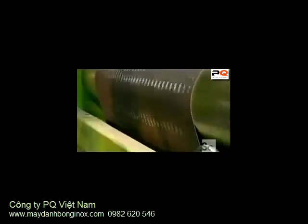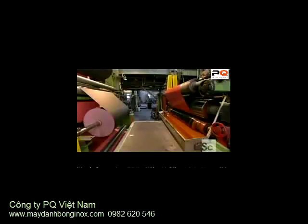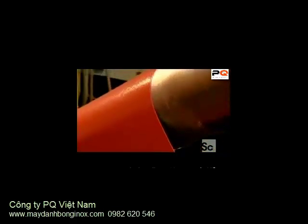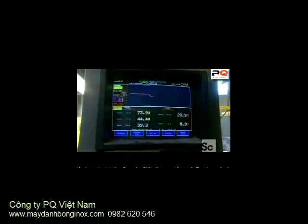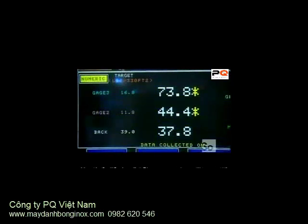The cloth then travels underneath the printing press, where more rollers apply a heat-setting adhesive to the unprinted side. A computerized system measures the density of the coating to ensure that it's been applied correctly.